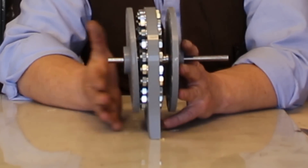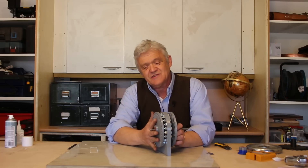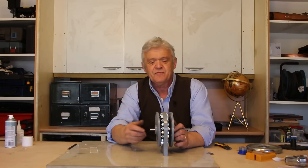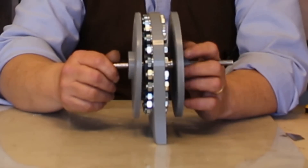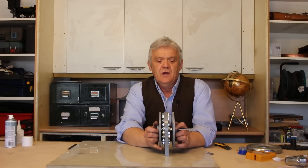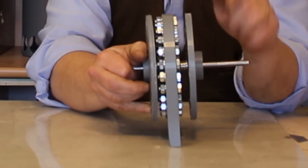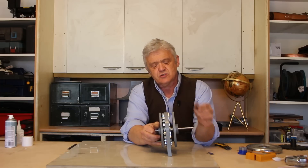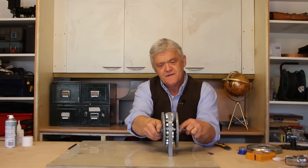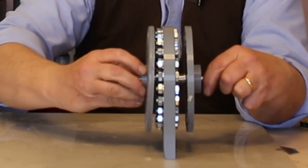These two magnetic rings just slide onto the axle. We could bolt wind turbine blades onto this, and bolt an axial flux generator on — just glue some magnets and put a coil on there. Because there's a magnetic gear, we get the 3-to-1 ratio. If I give that a spin, you can see this one spinning three times as fast, with a third of the torque.